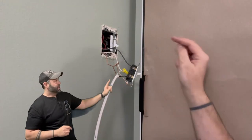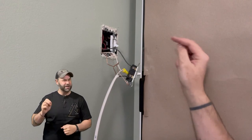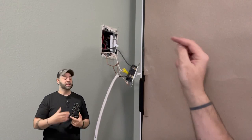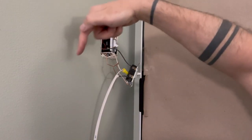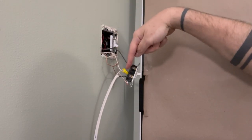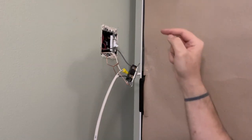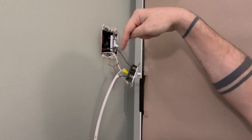A little context: what I was doing is called shorting your mains. In the electrical world it's considered not a good idea — very dangerous. If you're ever in my situation and don't really know what you're doing with electricity, please exercise caution. How I originally had it hooked up, I had the power coming in and tied off to the power line going to my lights, braided together going into one terminal, with the neutrals into another. Turns out that was wrong — you need a power in, then a power out, braid your neutrals together, same with your ground, and it'll work.